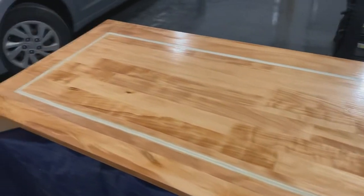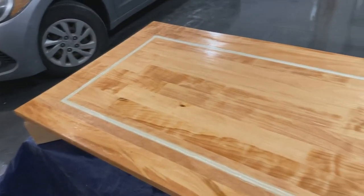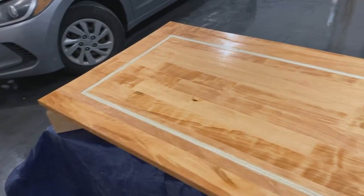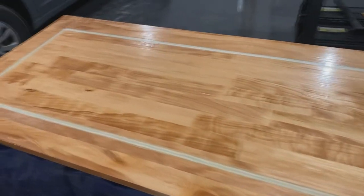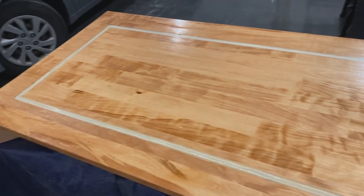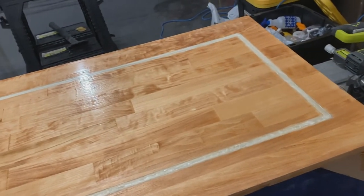Then I took a microfiber cloth, wet it a little bit and picked up all that sawdust off the top. You're not going to hurt it. I go back and forth pretty often between sanding after the fifth layer of polyurethane and not sanding. This time I decided to do it mainly because of those imperfections and risk the scuffing. And luckily it didn't happen. Because you're using such a high grit sandpaper at that point, 220 and 400, and if you really want to play it safe, just do 400. You won't get any of that scuffing. So that came out nicely.